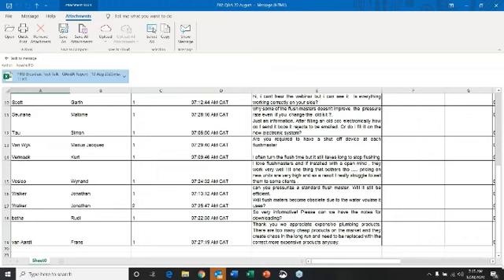Would it be advisable to install a strainer on a water supply feeding the flashmaster? Absolutely — if you think about all the things besides the work you do: solenoids, washing machines, dishwashers, pressure-reducing valves at the geyser, aerators at the taps — if you can keep suspended solids out of the plumbing system at the source, it's really the best thing you can do. A decent strainer with a basket that's easy to clean is good practice. On commercial jobs you don't want to keep going back — charge your client for a strainer and put it in.